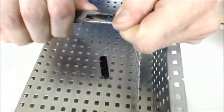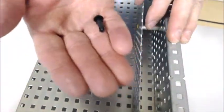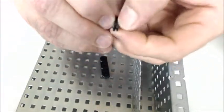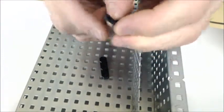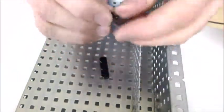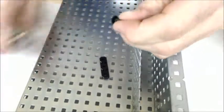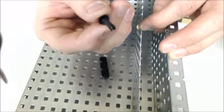You don't even need to completely separate the pin and the cup to use it again — this is ready to use. The only time you wouldn't be able to reuse a rivet is if it's pushed all the way in and the end is flowering out, so it won't fit into the hole. If that ever happens, just get a pair of pliers and back it out a little bit until it's not flowered so much, and then it's ready to use again. That's how you use bearing rivets with bearing flats.